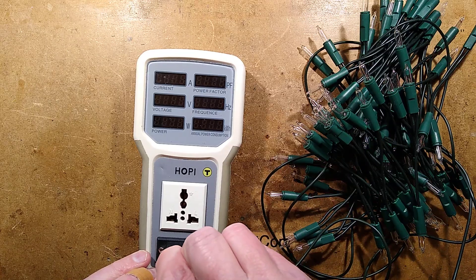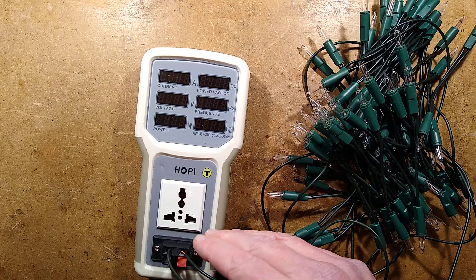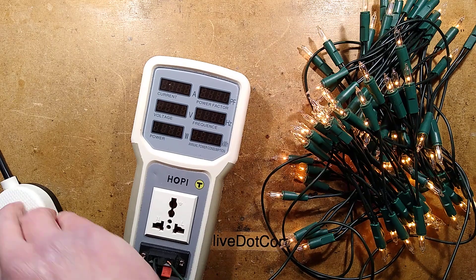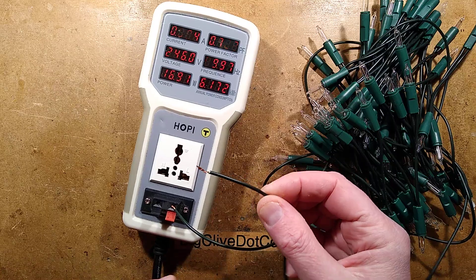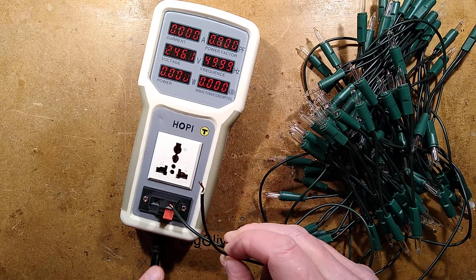Let me shove these wires in such that there is bare copper sticking out the top. Note that if you ever use something like this — and I don't really recommend it — don't ever connect wires while it's live, because if you disconnect a wire, like I'm disconnecting this one now, that will pass current through the load and you could get an electric shock off that wire. Just be aware of that.